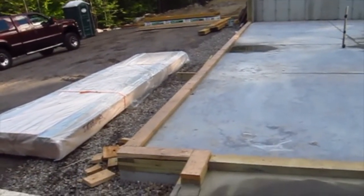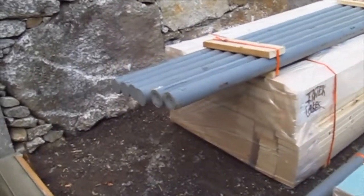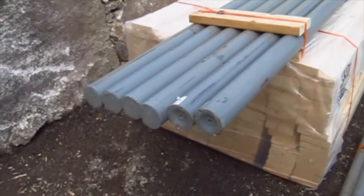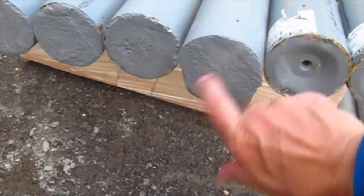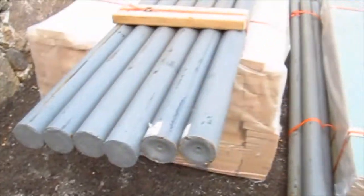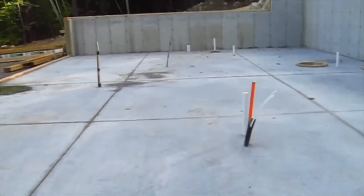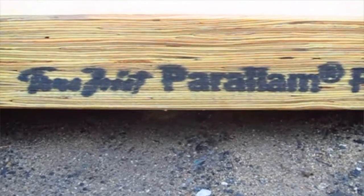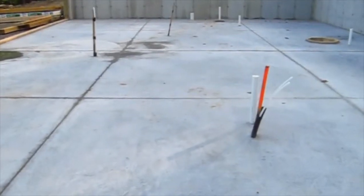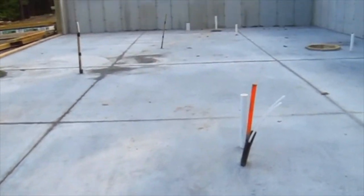And then what's going to happen is they're going to set some stanchion posts. See these gray? They look like electrical conduit, but it's not. These are steel pipes that are filled with basically mortar. So they're very stiff. And they're going to put those down the center of this basement. There's not a doubt in my mind. And one of those giant beams, one of that very, very long beam, is probably going to go on top of those stanchions.